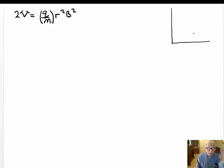And so we linearize the relationship. And if it is supposed to be a straight line that goes through the origin, and it doesn't go through the origin, but it's still a straight line, I know one of my measurement instruments needs recalibrating because it's got a DC offset, and that's experimentally really useful. But my answer for my slope will still be correct. And if it isn't a straight line, if it's clearly some kind of curve, then I know that I have a problem with my basic equation. Something's not right. I'm not doing what I think I'm doing.